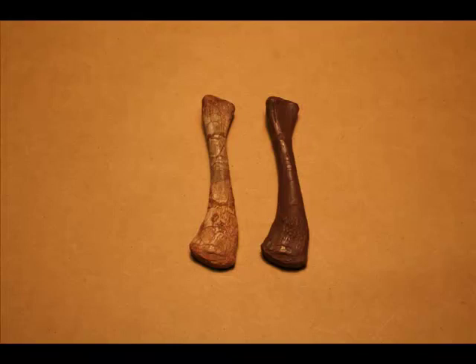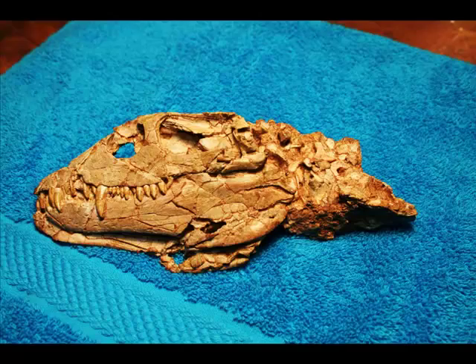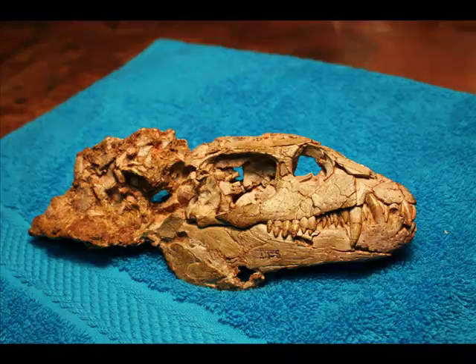This is the cast of the femur alongside the actual femur. I'm including this and the next slide mainly because of objections Marilyn Fox raised to my methods — specifically that I always vacuum the rubber directly on the specimen. Marilyn objected, thinking that vacuuming rubber on the specimen increases the probability of damage by infiltration into the specimen. My position is that if the specimen is well enough prepared to be cast, vacuuming directly on it doesn't increase the risk, but it does greatly lessen the possibility of bubbles in the registration coat. Here is the skull after the process was completely finished — zero damage, absolutely none. I'm waiting to hear from Marilyn at the end of this talk.